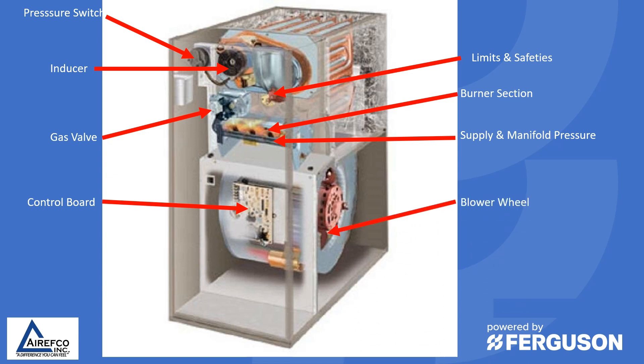When filters are not changed periodically, the blower wheel can build up dust and corrosion, limiting the efficiency of the blower wheel to move and circulate air through the furnace. Make sure you double check the blower wheel to ensure it's not caked up with dust and debris and that it's moving the air as designed. The blower motor needs to spin freely, draw the proper amp draw, and produce the CFM required for the furnace. Double checking the blower motor — whether it's a regular PSC motor or an ECM motor — for proper operation is part of a furnace tune-up.